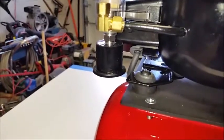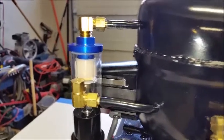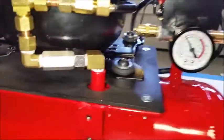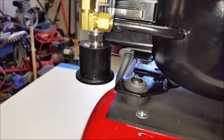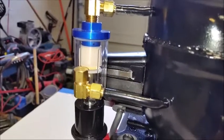When you hear this, mostly what you're going to hear is air coming into this. If you're wondering what that is, it's just a paint gun water/oil separator — this compressor seems to pick up a lot of water from the atmosphere. I'm hoping that's going to mitigate some of the moisture precipitating out. What I did is get a PVC one-inch cap, threaded it with a quarter-inch pipe thread, and put a piece of filter foam in the bottom to keep dust out.